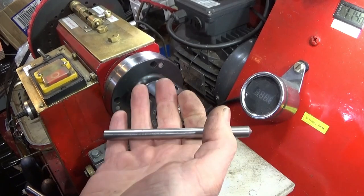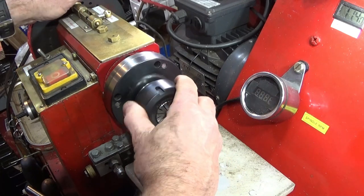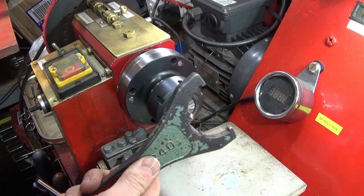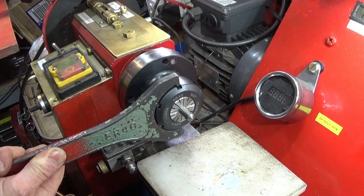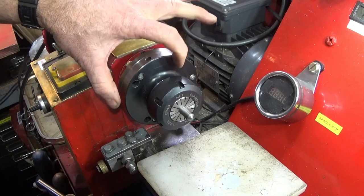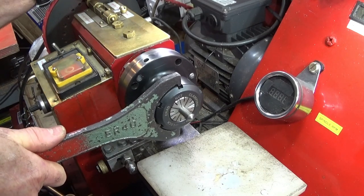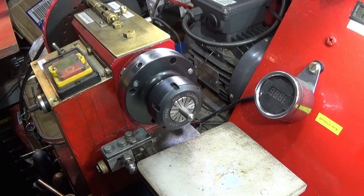Then I use a piece of ground 10mm bar as a test piece and tighten that collet up. I like these type of spanners best for the ER40 and the ER32 — they're much safer to use. I'm holding my pulley wheel at the back and locking that up, but I might make a bar up so I can put it in the holes here to have a type of spanner to hold it, which would make it easier. Now that one's ready — let's see how it runs.